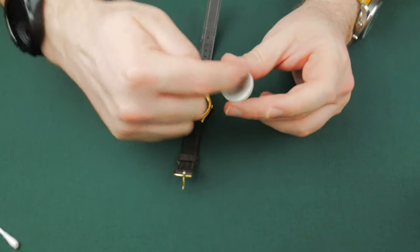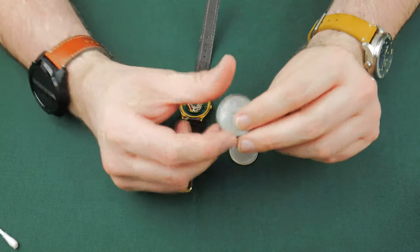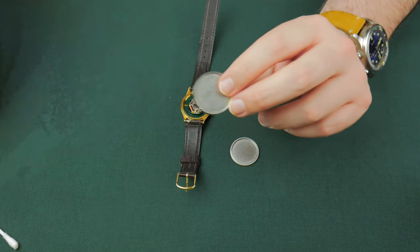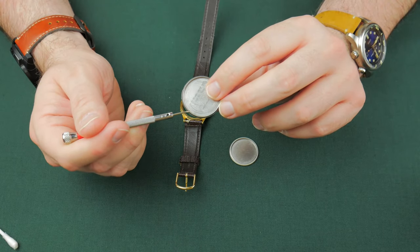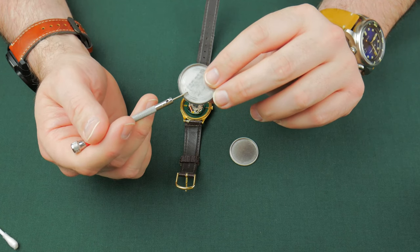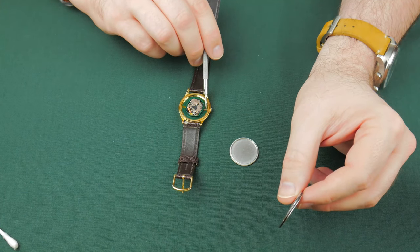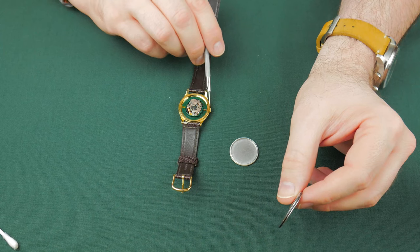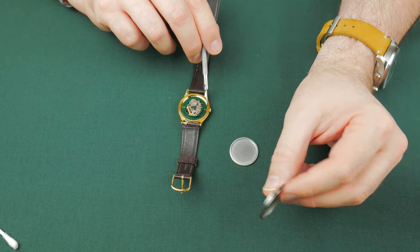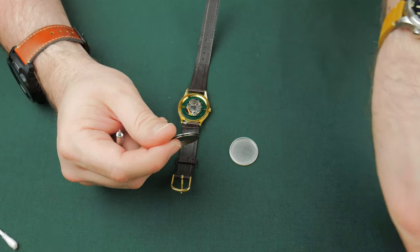Now, one thing to watch out for when you're putting these press case backs on is that sometimes, and it's not the case on Goofy's here, it's a smooth ring around the back. Sometimes, like on Marvin's here, and he's got a tiny one, you'll see a little divot, a little cutout, and it's right here. Be quiet, Windows. Nobody's talking to you. So you see this little cutout right there. This is where the connector that goes from the movement over to the crown is going to fit into this divot, and you want to be very careful when you put the case back on that it does in fact fit there.